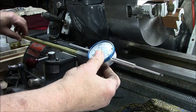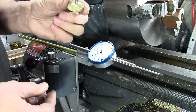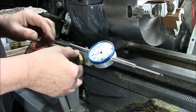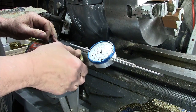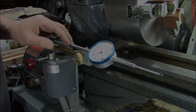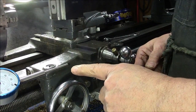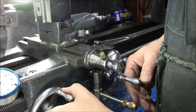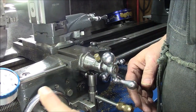There's a knob here that I fabricated out of brass with some knurling, and it's got a little brass tip on it so that when I tighten it down it doesn't mar the brass rod. It secures the rod in place. Here's the other end — the tip of the indicator — and it just rides up against a square surface on the cross slide casting.